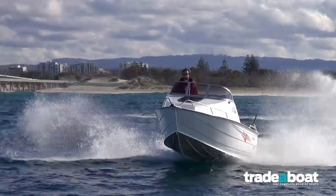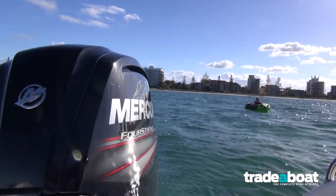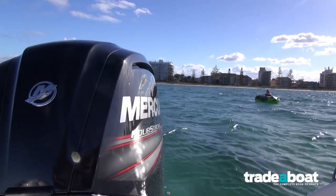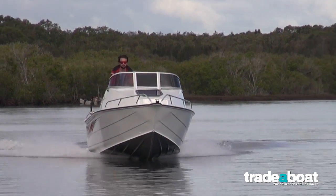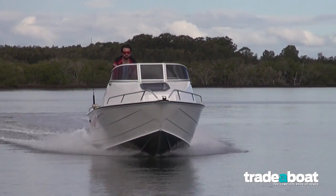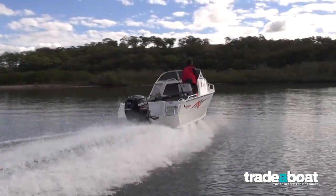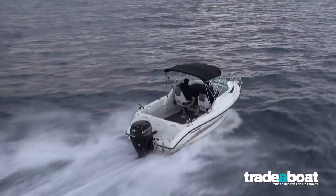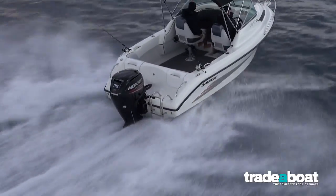However, if you're going to push heavier boats like pontoon boats, or you have a boat where you're taking out the family all the time and towing a skier, you've got the Command Thrust which is 2.38 to 1. What it does is it allows the engine torque to be converted to thrust more effectively, so you can actually get the power down into the water to push that bigger boat and pull around those heavier loads.